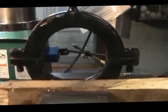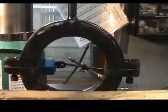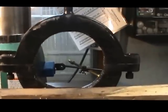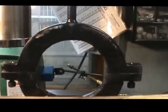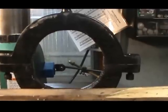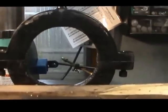All right, we've completed that second hole that we left you with just a few minutes ago. I've now had the good old experience of putting the two pieces together and starting the Allen cap screws, and they both are threaded into the piece from one side to the other, and the alignment is good from side to side and end to end. I've minimized the clearance between the bolt hole and the threaded holes so that there's very little slop in there. That's going to help keep the two sides aligned.